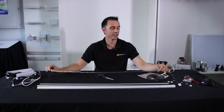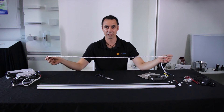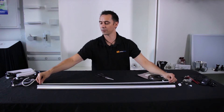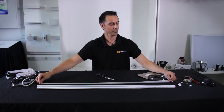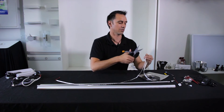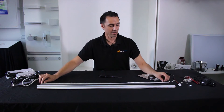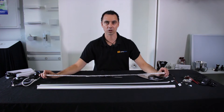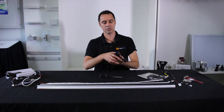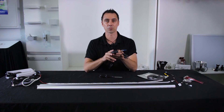We need to allocate a transformer or LED driver to the strip. This strip is cool white low intensity at 4.8 watts per meter. I'm going to measure out one meter using the slimline mounting profile as measurement, then cut the LED strip at the indicated cut points. We know it's 4.8 watts, so we need a suitable driver — here I have a 12 watt 12 volt DC driver, which is well within its limitations.